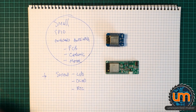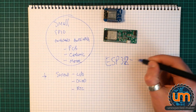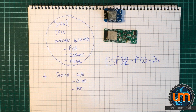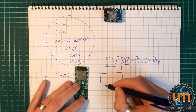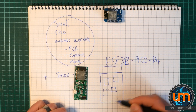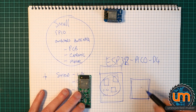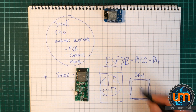He wanted to make it using the ESP32 Pico D4, which is a newer chip. Inside a standard WROOM module there's an IC for the microcontroller, some IC for flash, a crystal, and a whole bunch of passives. What they did with the Pico D4 is they made a smaller IC where all of this was inside the die — it's not separate components, all of this is inside one chip. It's a QFN, it's smaller than the module, but it has no aerial. It has built-in crystal, built-in flash, and is fully pin-for-pin compatible with the WROOM32.